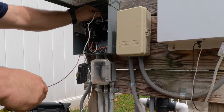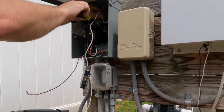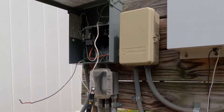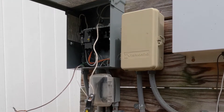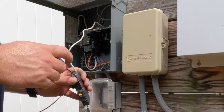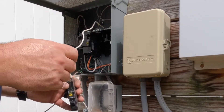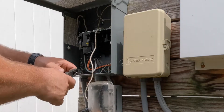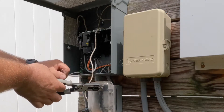I'm working live here and hooking up this GFCI circuit breaker. The way you hook up a GFCI circuit breaker is: there's a neutral wire that comes off the breaker itself and that goes to the neutral bus by itself. Then the circuit neutral gets attached onto the breaker's neutral terminal, and then of course the hot wire goes to the hot terminal. And that's how you set up a GFCI circuit breaker.